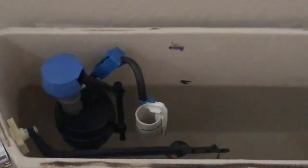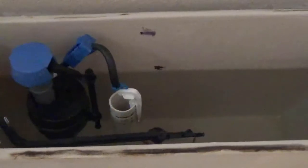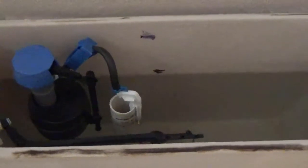Here's the toilet tank, and this is the old fill valve. You can see the orientation. I've already marked the water level. I have a container down here. I'm going to flush the toilet right after I turn the water off. Then I'm going to drain the water as much as I can.